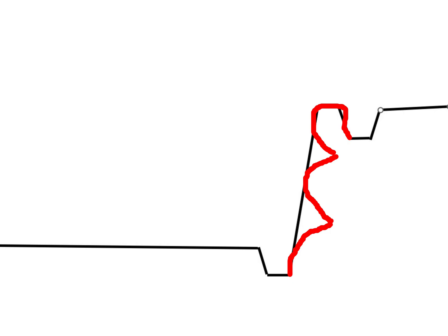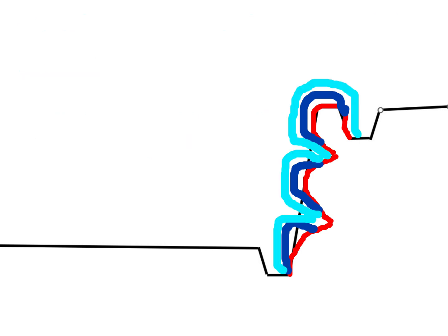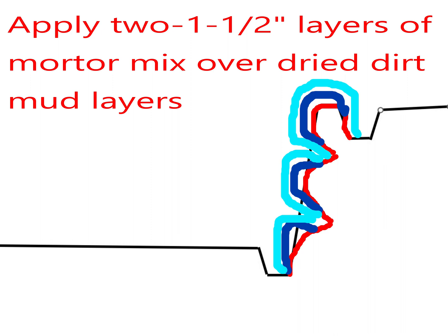You're digging in to get some definition started. From there, I'm laying dirt mud that I got off the wall — I throw it in the mixer with water. If it's sandy, I'll throw in one scoop of Portland, but I'm still using a no-cost material to build out the definition. In this job right here, I was astounded watching it go through. We had dug the bank — you see me putting some mud on the bank — but as I go forward in the footage, I did not continue adding more dirt mud to build out the definition, almost to the point where it is beautiful.